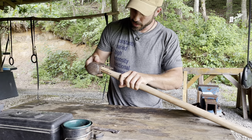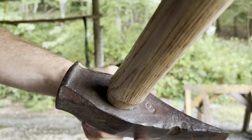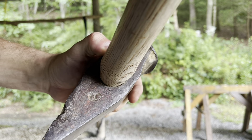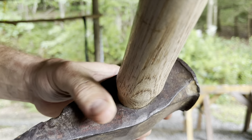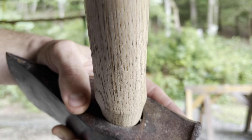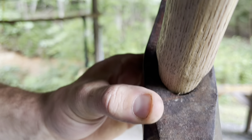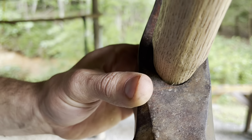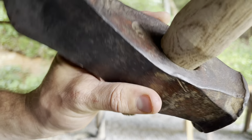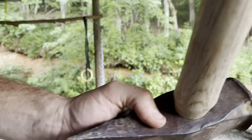I'm just going to do a quick little test fit here and see how it's going to fit. I just tapped it on there gently and what I'm looking for is basically no space, no gaps right here where the axe head or maul head meets up with the handle — I want that to be completely closed off. You can see a small spot in the back that's a little bit loose. That may go away as we pound the axe head onto the handle, but I might need to shave just a little bit off so it'll go a little deeper.